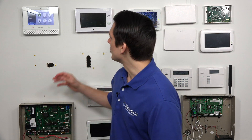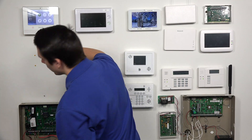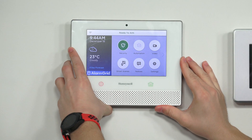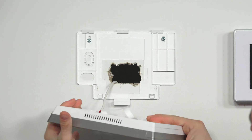If you want to change out the battery backup for the Honeywell Lyric, just follow these simple steps. First, take the system off of the backplate. Look at the bottom — there's normally going to be a screw at the bottom holding it in place. You'll need to take that out first before you take it off the backplate. Once you do, push the system up and then pull the system towards you and it will come off the backplate.